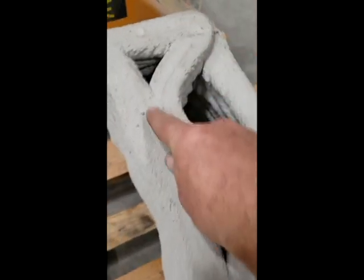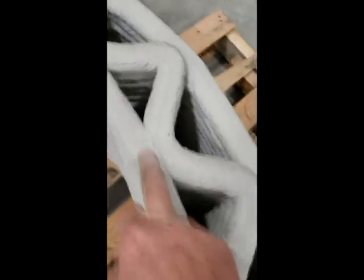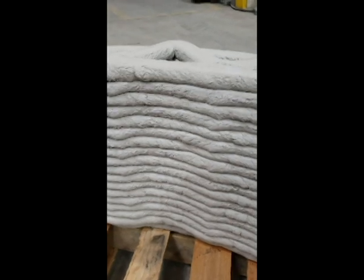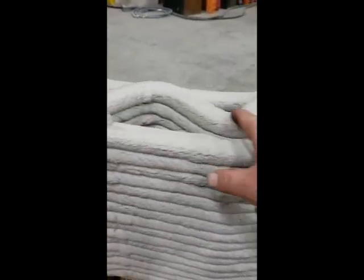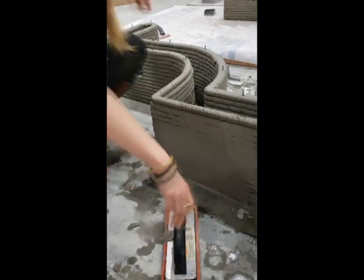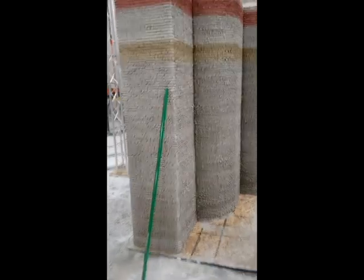Here's a worse example — you can see in the design it's coming clear out to the perimeter print line, and this is the result. It's important that whoever is doing the drawing understands the effect of the drawing. If you want something very consistent, each internal support would have to be the same, and it's plain where it crosses into your perimeter print. If you're going to finish the wall with a sandy effect, the perimeter consistency is less critical.